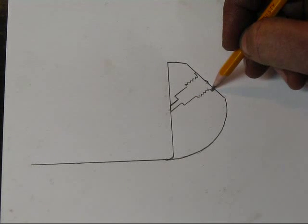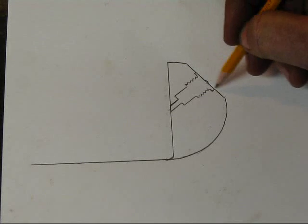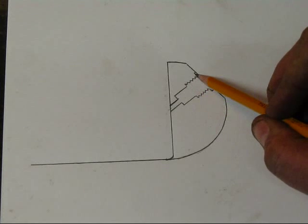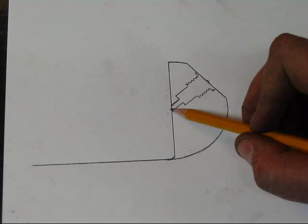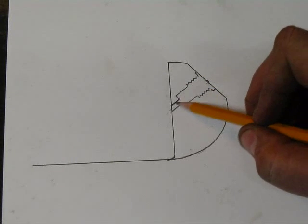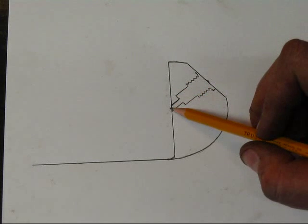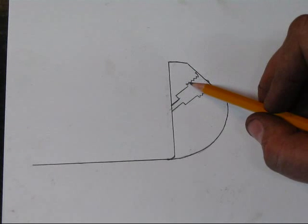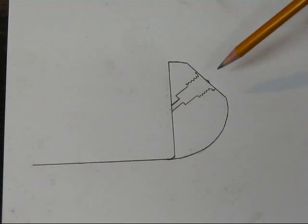There's a slight shoulder that gets relieved with a slightly larger diameter to allow it to thread down and shoulder tight to the section machined flat on the dome. This is done in stages, progressively going from firing pin diameter to thread diameter and then a relief cut. What this does is if you ever rupture a primer, the firing pin backs up and the shoulder on the firing pin stops against the thread shoulder of the retaining nut, and it gives the gases somewhere to escape. It's a pretty safe system — I've never had a primer rupture with this setup, but it's a good safety feature. A shouldered firing pin that butts in tight takes amazing amounts of pressure to remove.